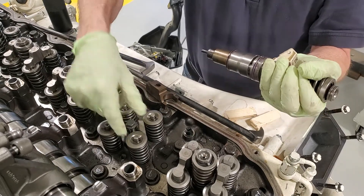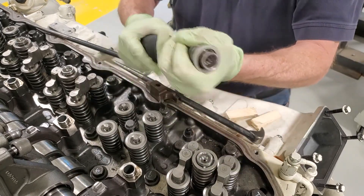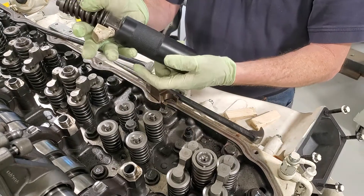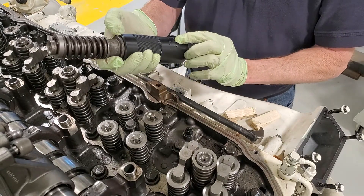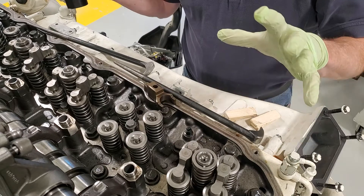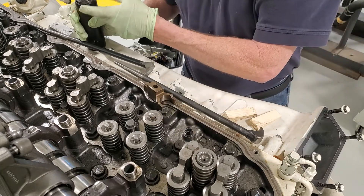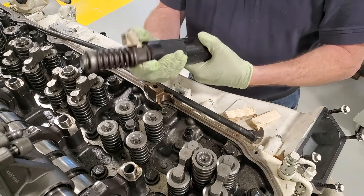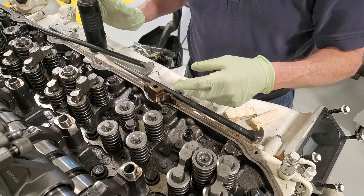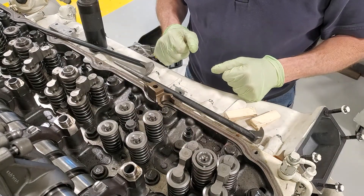I'm going to take the unit injector out and put that plug right back in there — and that fills the hole. The other cool part about the tool is that it fits the unit injector, so now it's airtight with that O-ring. It comes as a set of six; the part number is 999-8249. This is definitely a special tool I'd want if I had a fleet of these engines or was servicing them in the marine world — even if I pull one out while it's being moved, I want to keep it as clean as possible. That's how you pull the injector out, and you can use a little bit of ingenuity to get it out that way.